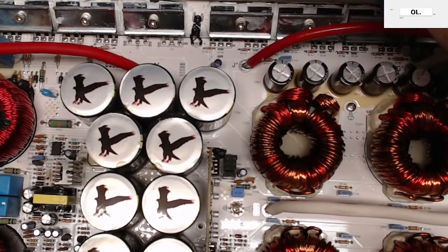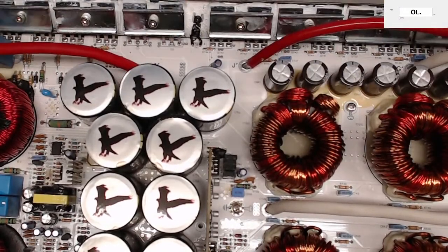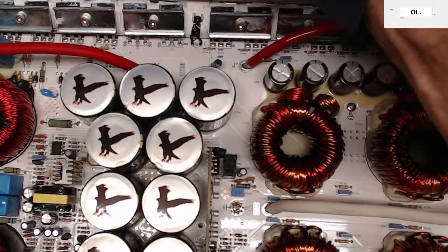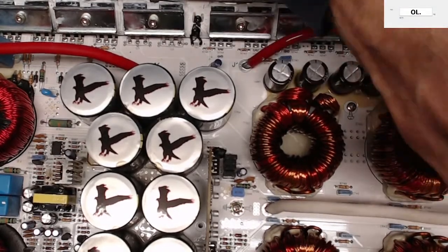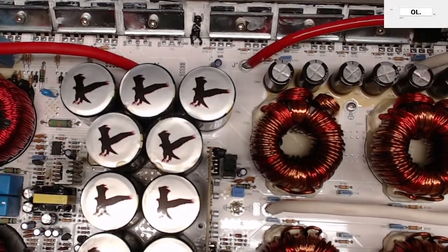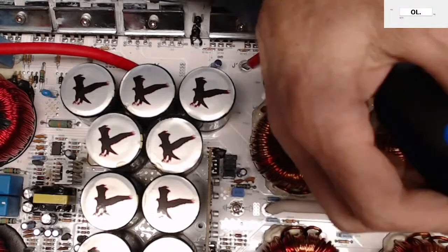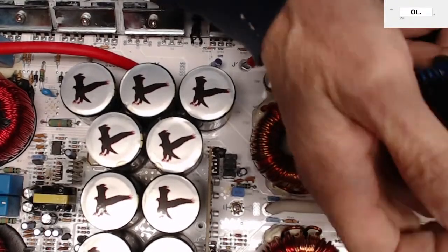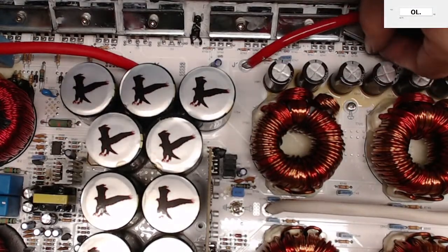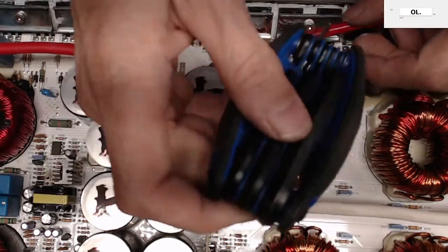We're just pulling apart a B2 here real quick. Looks like this B2 got a little toasty on the auxiliary power for some reason. I don't see very many auxiliary power failures. So the question is what has failed on the auxiliary power to make it short out like that? Any hints there, guys, or any clues? Remember, this uses the 2110 ICs to drive the outputs. There are no transistors. There's no buffers in between. So the 2110s are directly driving the transistors.